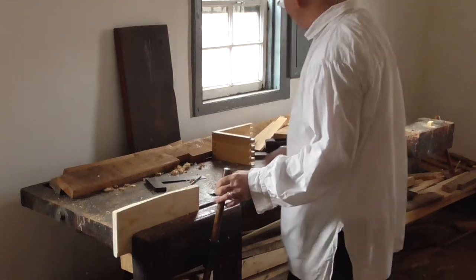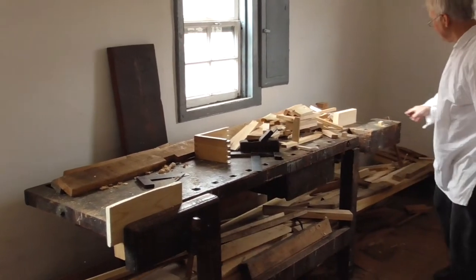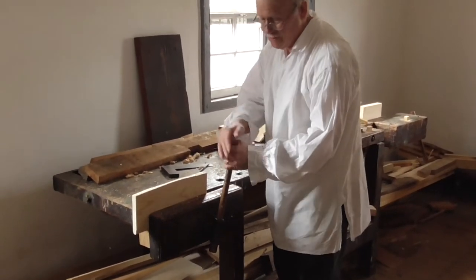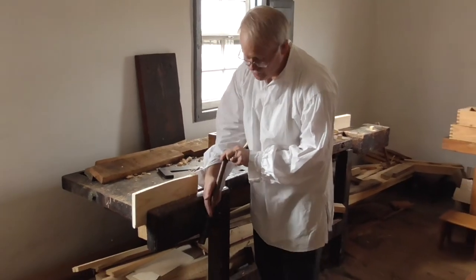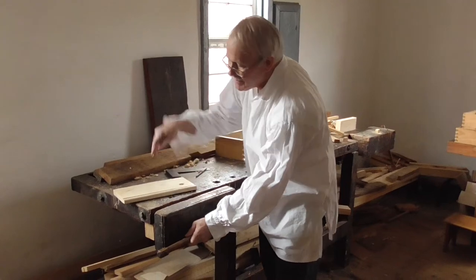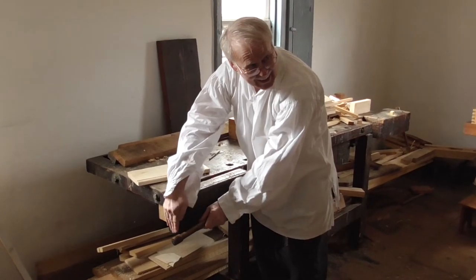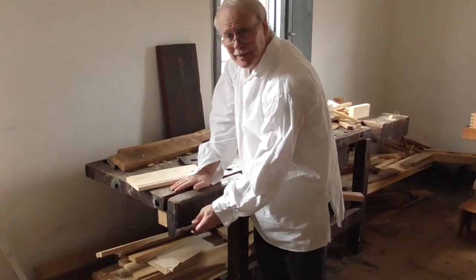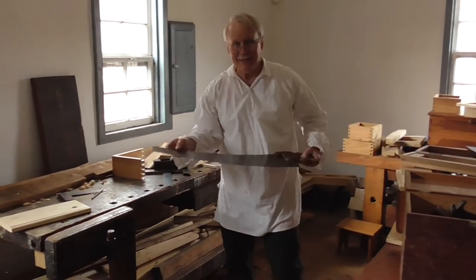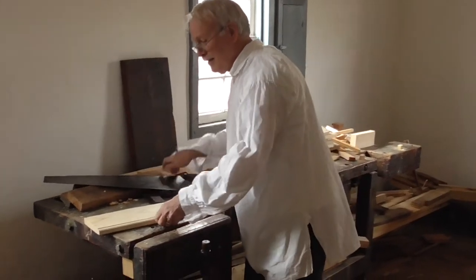You also notice we've got this wonderful woodworking bench here. This is called a front vise, and this one here is called a tail vise — I'll show you the tail vise later. You also notice that woodworking vises have a wooden handle — if they're original. There's a reason for that. If that handle's out this way and you're sawing and you accidentally, when you go through the board, hit the handle — if it's a wooden handle, you just nick the handle a little bit. If it's a metal handle, you have no appreciation until you actually sharpen the hand saw — the time and effort it takes to sharpen the saw and how quickly you can mess it up. So they have a wooden handle for a reason.